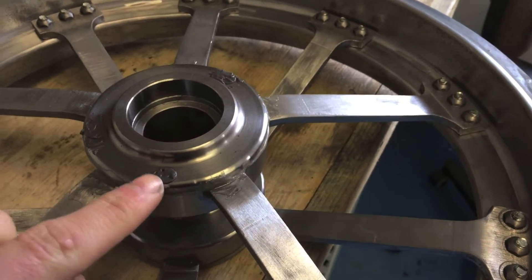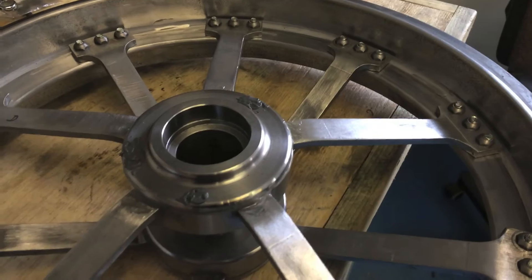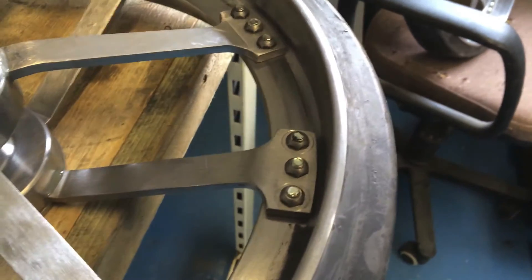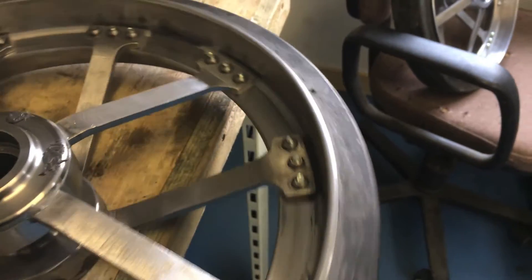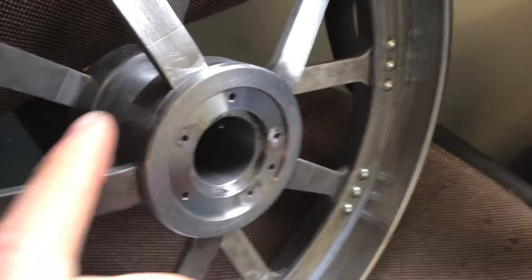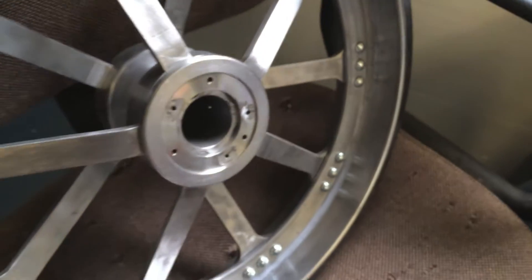You can see where I've filled the screws that hold the covers on, and then you can grind these back smooth. You can see the backs of all the rivet nuts need grinding as well. But if we look at this one, you can see I've already filed it all down so it's all smooth there. So this one's basically ready for painting now.